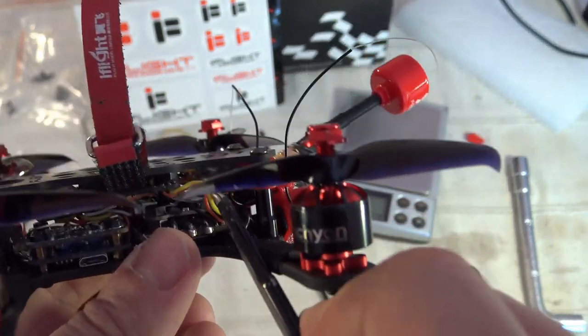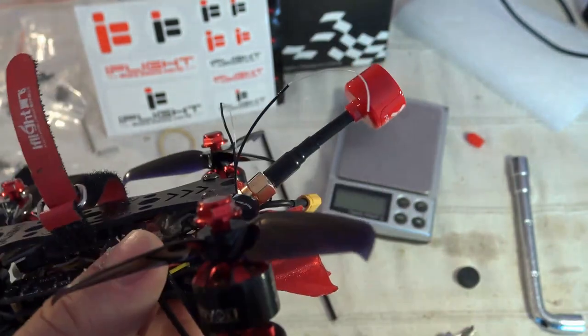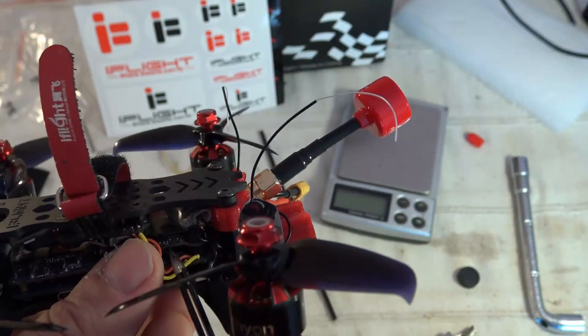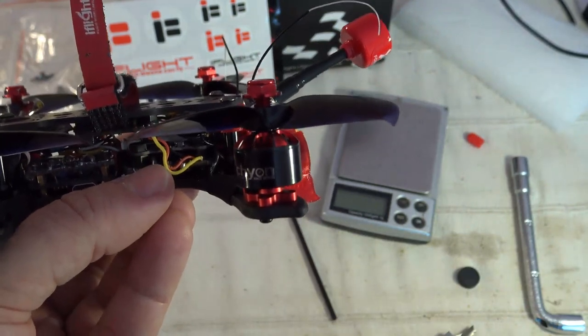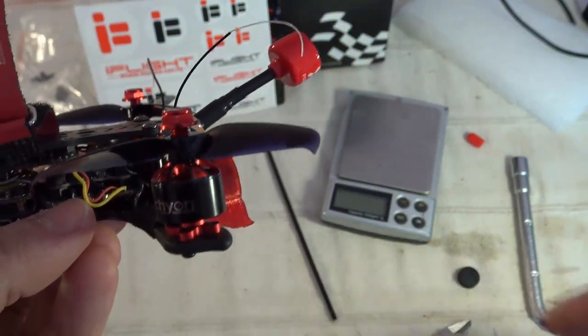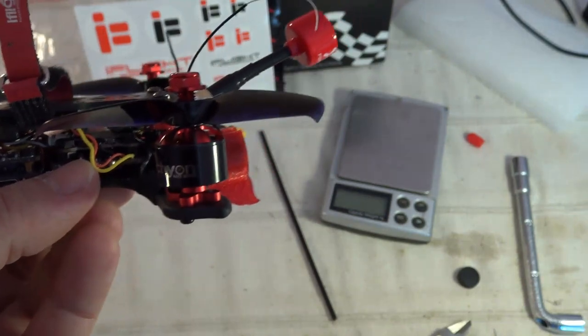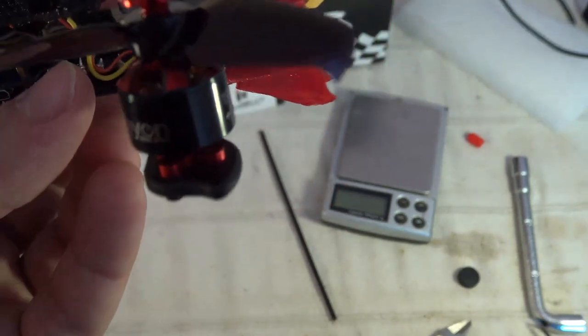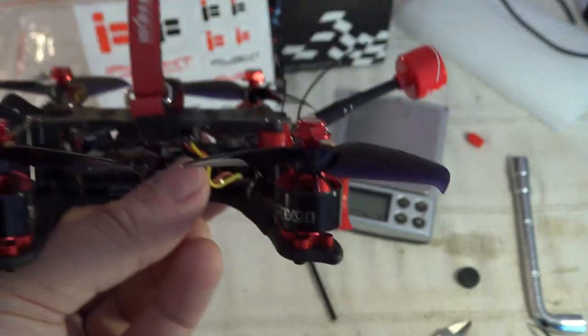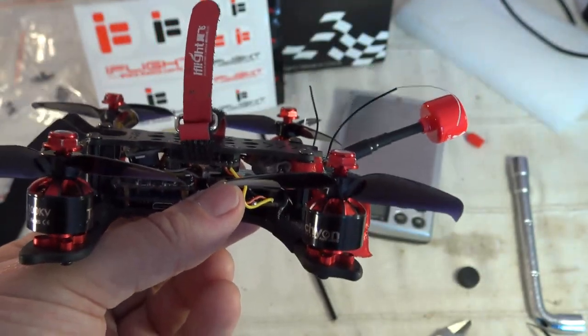Here you can find the video transmitter button. If you short press, you will cycle within the 8 V frequencies inside the currently selected V band. Long press more than 2 seconds, you will cycle between the different V bands, and press more than 10 seconds, you will cycle between the different output powers.